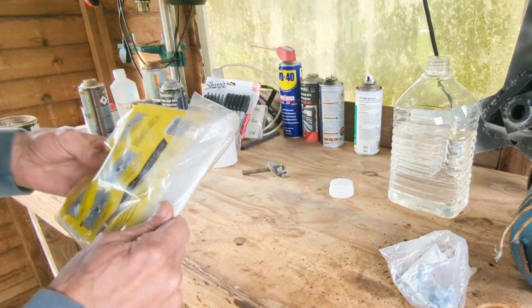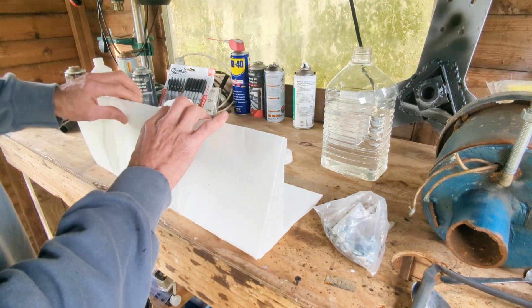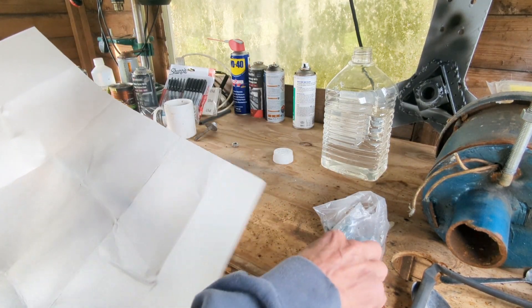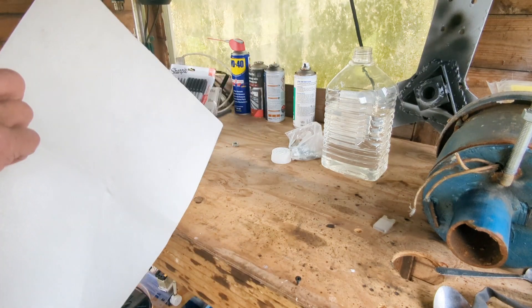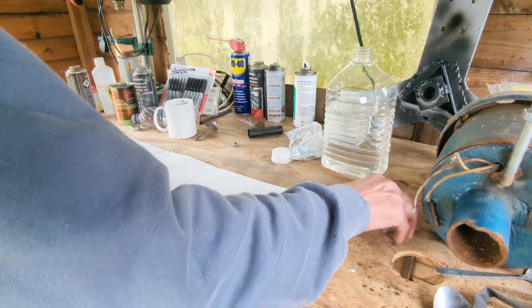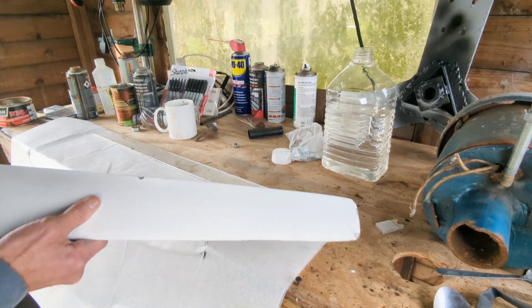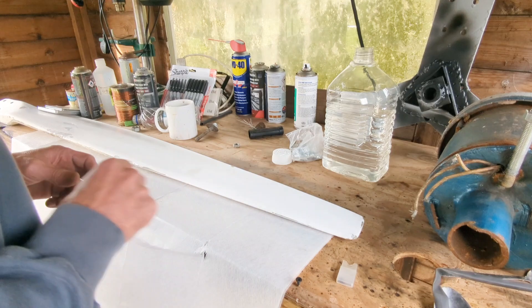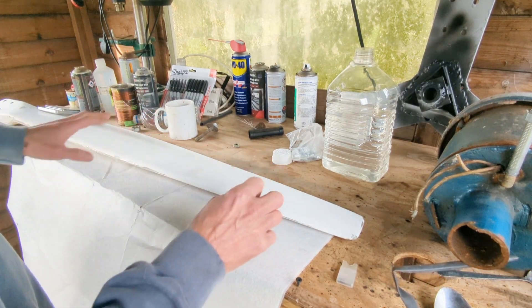That's the thinners — I'll put that aside to dry. As this sheet is one meter square, I want to cut a sheet as long as I can, roughly the shape of the blade. The blades are 1.4 meters long so we can't do the whole thing in one go. I'm going to cut it like so — I'm not wanting to wrap the fiberglass around the ends, I just want to cover the face.